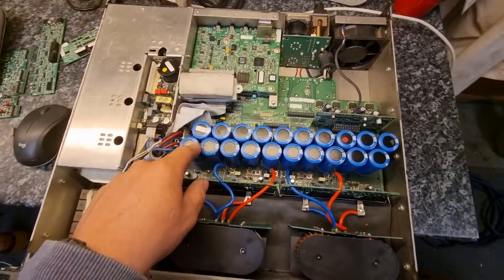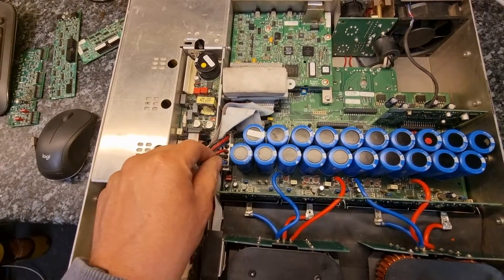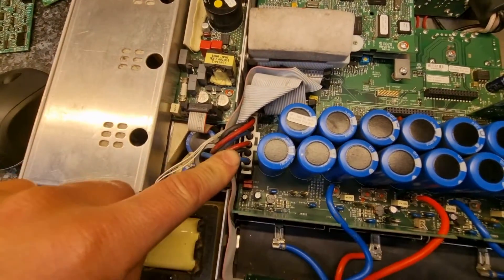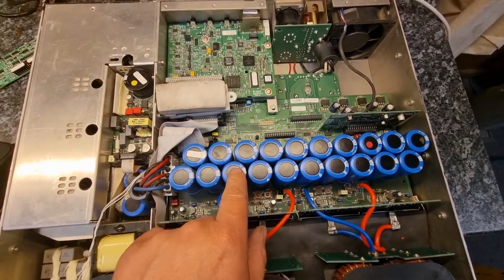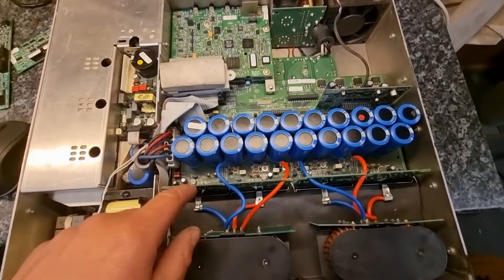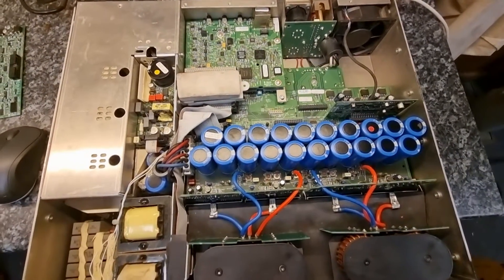That is what makes these amps particularly dangerous. If this amp was powered on — it's a MAi 12000 — between the red wire and the blue wire there's 400 volts DC, actually about 405 volts with the capacitor bank behind it. That will kill you. There's no messing about. If you somehow manage to touch across those terminals, and it is possible because they're present right there, you're in big trouble and you're not going to be around to tell that tale.